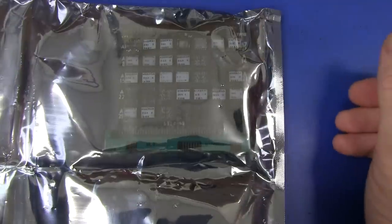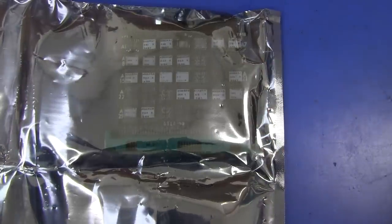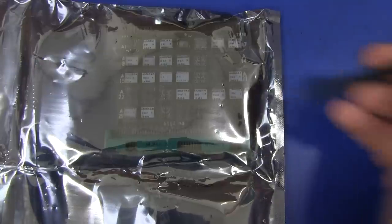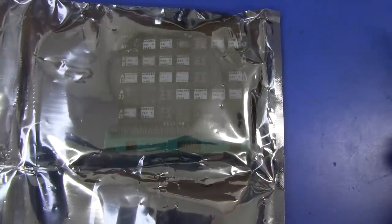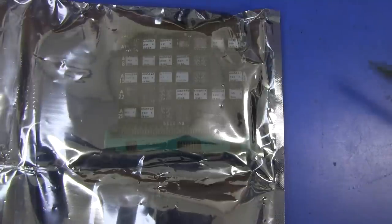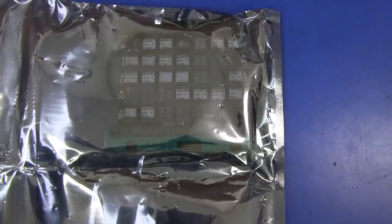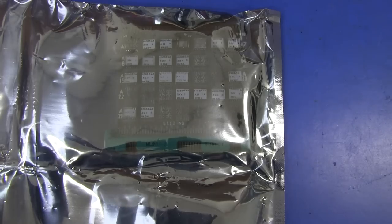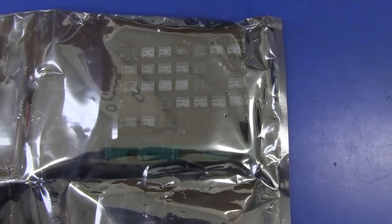I was just thinking — it comes in an ESD shielded bag. Would ESD have even been an issue back then? At the massive scale that these chips are at, ESD becomes a problem at the smaller manufacturing geometries you go with in silicon. I wonder if they had even encountered ESD problems back in the day of all this Apollo hardware.